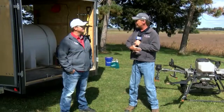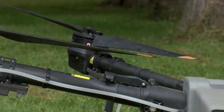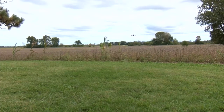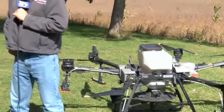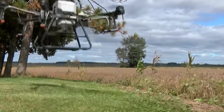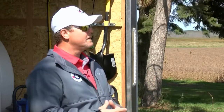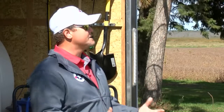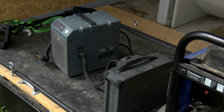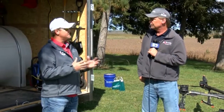Could you tell me a little bit about the specifics of the T30 drone — battery life, how to set up the fields? Typically when we start to think about using drones on the farm, questions come up like how long does a battery last and how many acres can it do. With a fungicide on corn, for example, we're applying at a rate of two gallons per acre. We can carry eight gallons, so the drone will go out, complete four acres, and return to its home position — typically a completely automated, autonomous operation. If you're not ferrying a long ways to your field, it will come back with 40 to 45 percent battery remaining. We have three batteries for every drone, and by the time you need the third battery, the first is recharged and ready to go. So you can continuously run all day with three batteries.